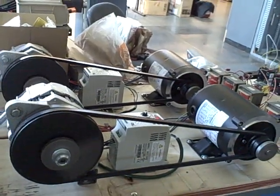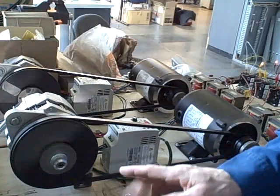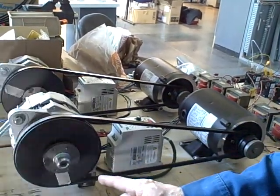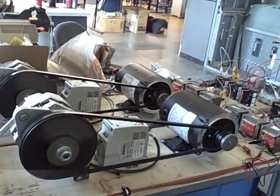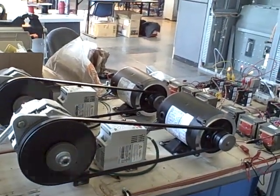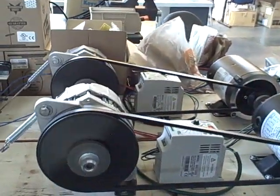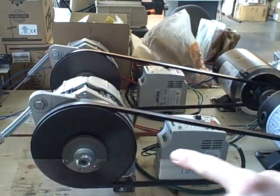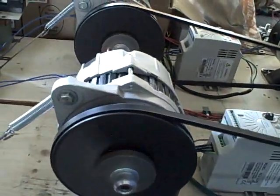What I'm going to do is wait for these lights to go dark and close the breaker again, but I'm going to do so at a different position. I'm not going to wait for this tape to come around to that position — I'll do it in some other position when they happen to be in phase. So here, we see a condition where the two generators are locked together. You can see that piece of tape appears to be standing still, and that piece of tape appears to be standing still, but they're not exactly in phase.